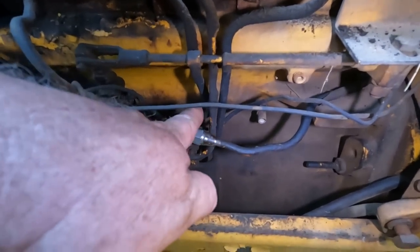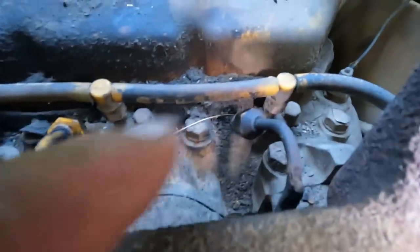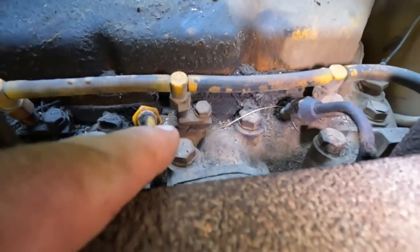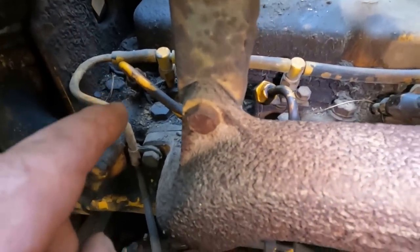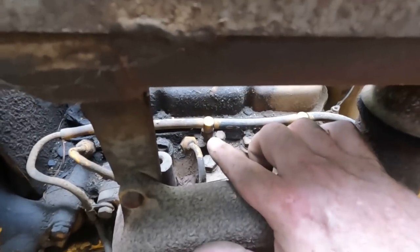In this case it is a 3-cylinder. There's 3 lines, each going to an injector. Up here at the injectors, these are basically like a pop-off valve where you put high pressure to them. And when they have enough pressure, they go pssst, and squirt the fuel into the cylinder. So that's each injector. Each one has a line. They get the pressure at the time that cylinder is supposed to fire, all determined by this injector pump. We don't have any fuel up here at the injector.